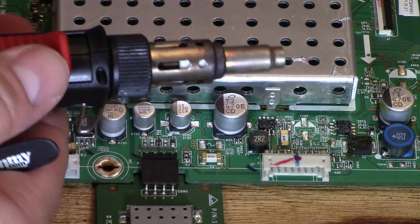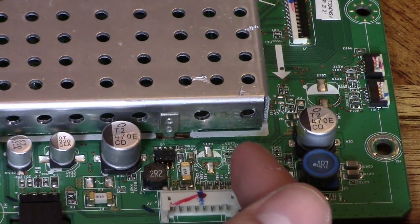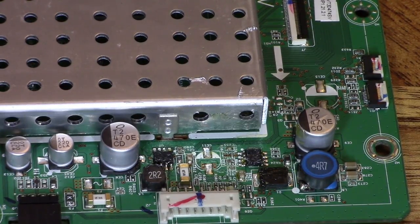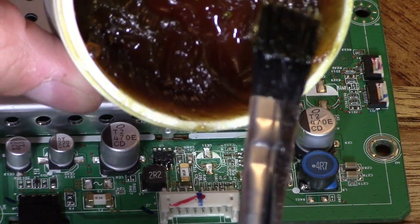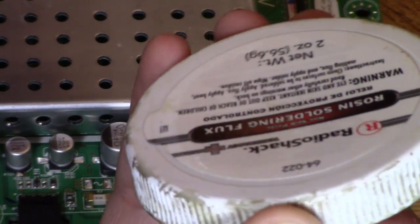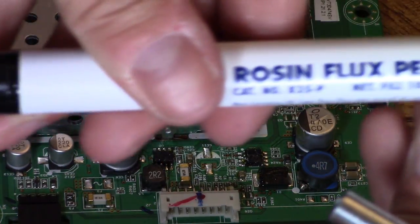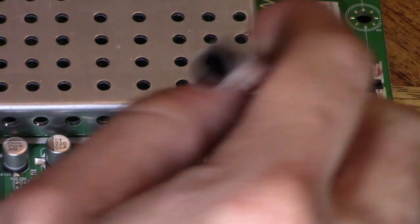You want to leave it on medium to low heat. I'm going to start off with this right here E-Prom and I'm just going to demonstrate. We're going to use a little bit of flux right here and a brush — you can use flux in a jar that works fine or you can use a flux pen. They both work pretty decent. I just like to overdo it with the flux.